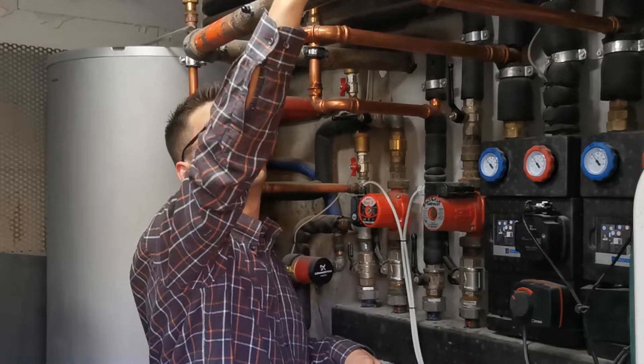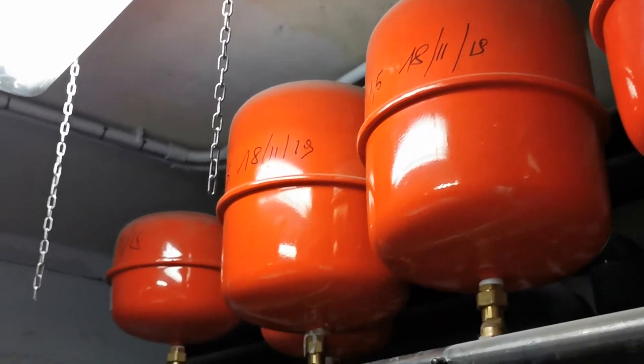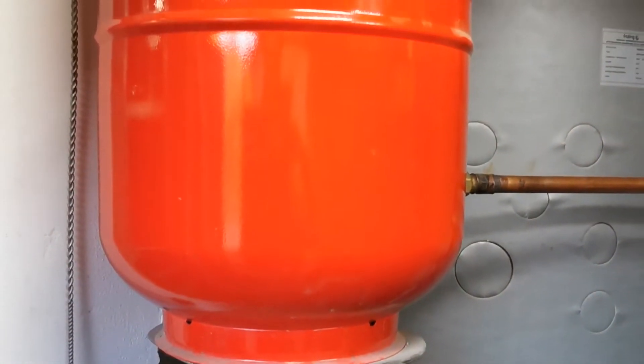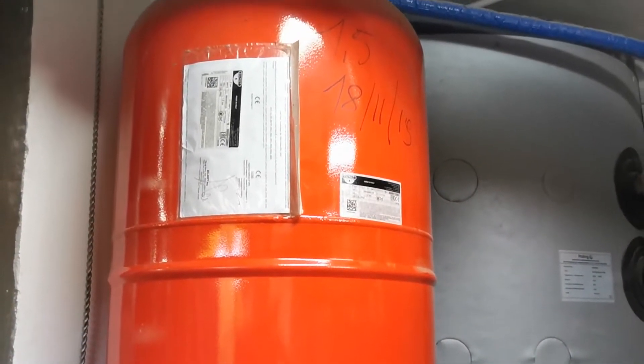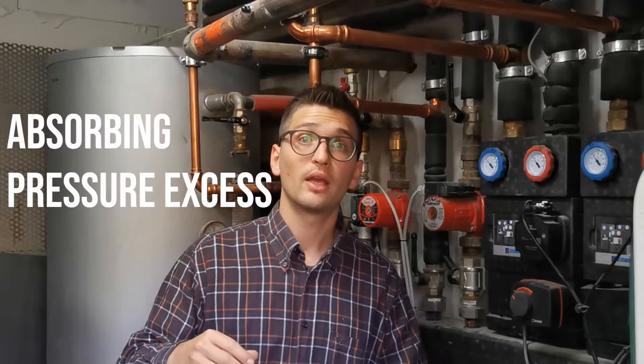Notice also up in the roof here the red tanks called expansion vessels. They are correctly sized for the specific circuit they are mounted on: you can find a big one for the main circuit — the boiler and heating circuit — and smaller ones for the heating circuits inside the house. They are partially filled with air — roughly half air and half water. The air is the compressible part of the circuit, and the aim of this component is to cushion shocks caused by water hammer and to absorb excess pressure due to temperature rises beyond the regime volume.